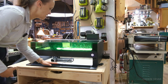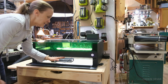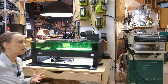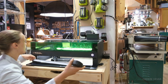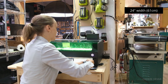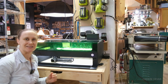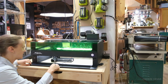What's the capacity of this machine? I have the riser block here — it's not necessary but it's an upgrade. If you are using the rotary to engrave round things, you do need the riser block; it lifts everything up and gives you more space to engrave thicker things. It also opens up on the other side, so if you had a really long piece it can go right through. We have about 24 inches to work with with the riser open, or about 18 inches closed, and in terms of height with the riser blocks we're at about four to four-and-a-half inches.